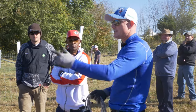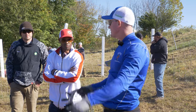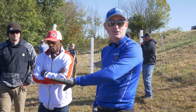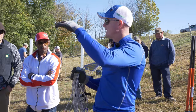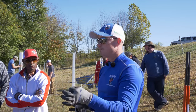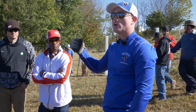I did the same training down there about a month or two ago and dug holes in two minutes and 20 seconds by myself — about 11 seconds per hole. The sandy soil is nothing like this hard dirt. With pea gravel mix, the smooth stones slip past each other — it's more work for the guy on the tamping bar to get good compaction. So we have a concrete company make a mix for us with 3/8 chat — a regular angular shape aggregate — no pea gravel, so when they're tamping it takes less effort.